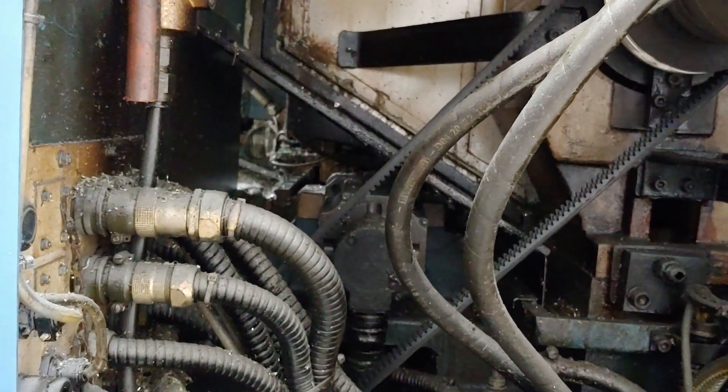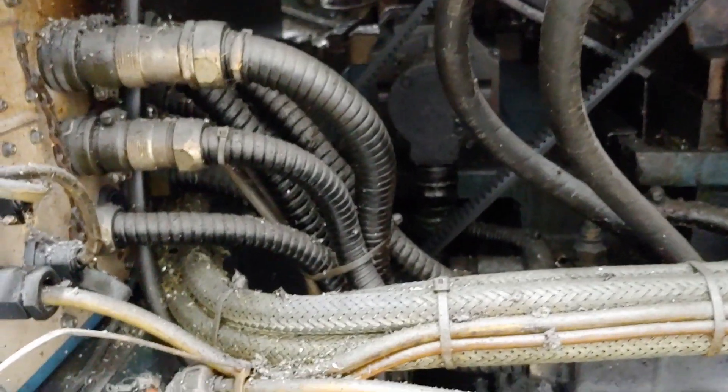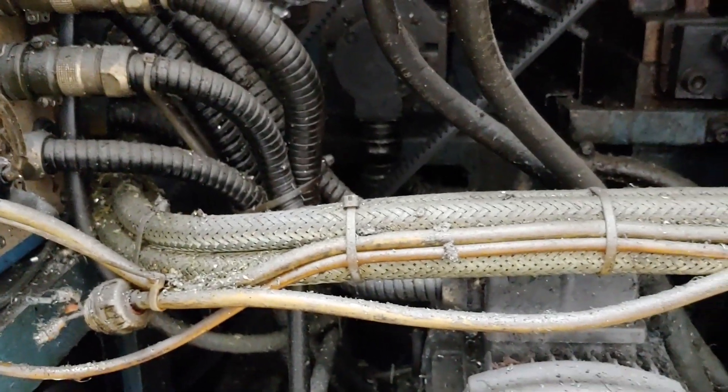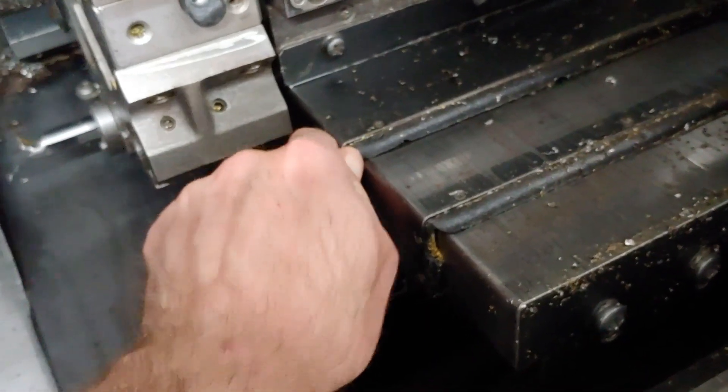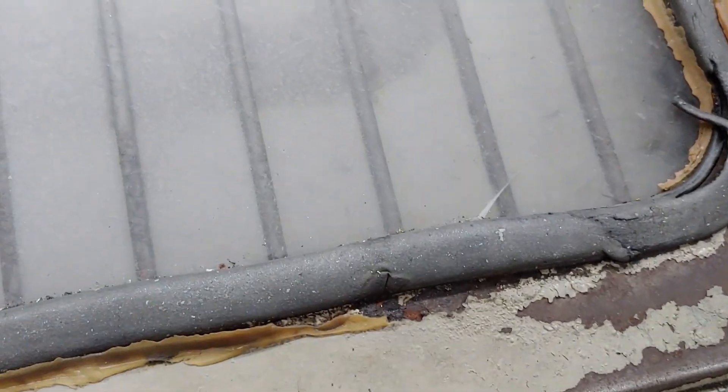The other thing I need to work on is the lube system and the linear rails. It's kind of hard to tell because I haven't broken this machine apart enough. But it looks like the seals on the trucks and everything are swollen and probably soft from the dried coolant crap on them. A lot of this stuff that goes on in a CNC machine tends to swell up and make rubber kind of gross. All this stuff is soft to the touch — like I can put my thumbnail through it. And all these window rubber surrounds are just squishy, and they shouldn't be able to do that.